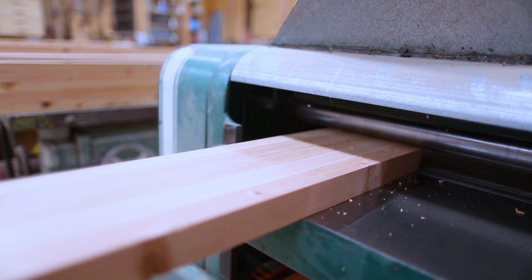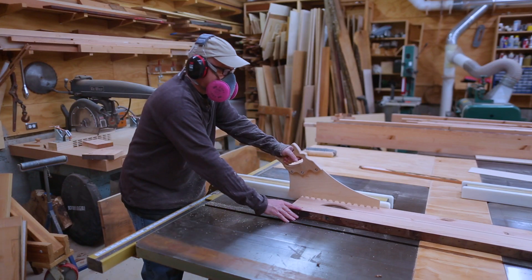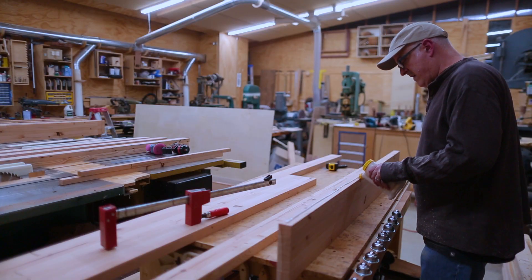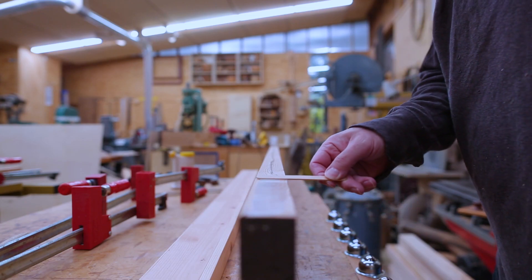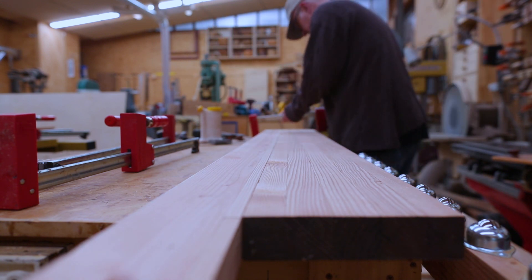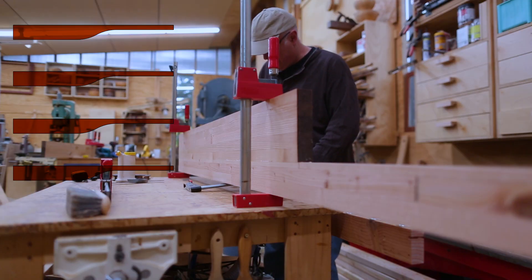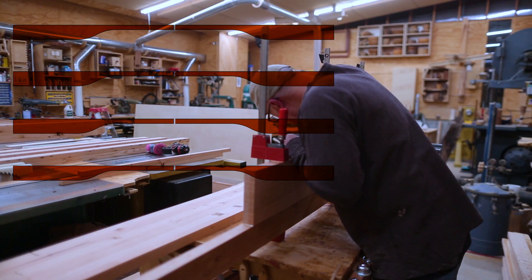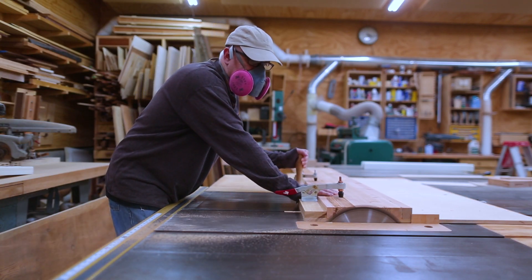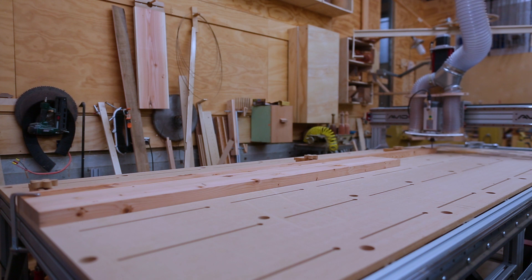Because I'm going to have a narrow part and a wide part of the shelf with a transition, I made up my blanks so that each one would have a narrow section and a wide section, and I could cut the curve into that glued-up piece. I made a bunch of shapes like panhandles — with a fat part and a thin part. There'll be four shelves, and I'm doing each side, so I need eight of these parts. Once glued together, I cut one side to the final surface and could put that on the CNC machine.